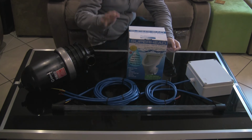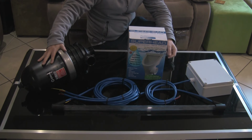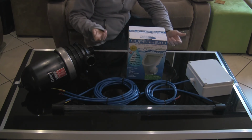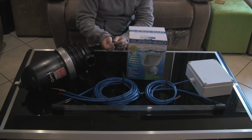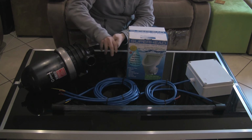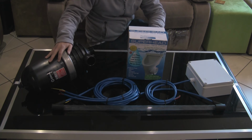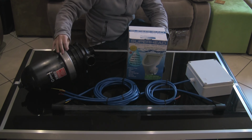and that it just becomes impractical to filter that water then. Then after your tank you would go for a pump, and after the pump we'd recommend something like a washable disc filter. What this disc filter does is it filters to a point where you won't have problems if you're using the water to, say, flush toilets. But typically with rainwater you get a very fine dust, and that sits on the seal surfaces, and that can cause the toilet to constantly leak, and the same for taps, which results in dripping taps. This would prevent that from happening, and it reduces your running costs because there's no filter cartridges which you need to replace.